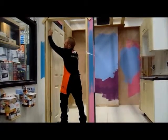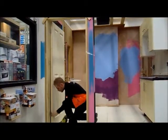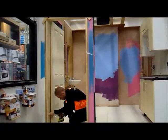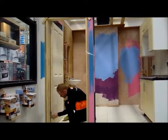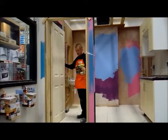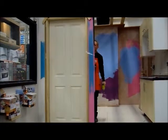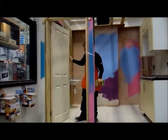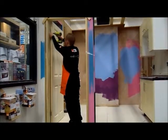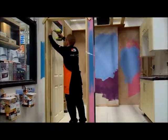Okay, so that's in the mortise. Screw that home. And then similarly, position the hinge in the mortise. Set the screw. What you can do is just pop one in momentarily in each hinge, and you can check to see if that's going to suffice, and see if the door is going to close and clear the jamb, the frame, for us. So just check that now, and we can see that it does. So now I can bring in the remaining screws very simply. Again, try your best to put the screws in such a way that they're seated squarely in the hinge.